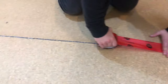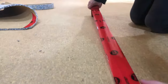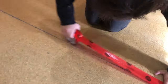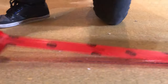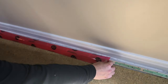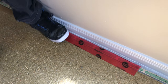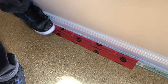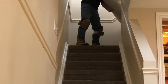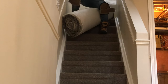The door is done. Now Robbie is putting down the tuck tape — the same tuck tape people use on the outside of houses. This stuff is serious; it's not going to crinkle or dry up. I've been using this for close to 10 years without one complaint. Masking tape dries up, shrivels, crumbles. We also put a little bit on the outside on the smooth edge because that marble is slippery — when we go to lay this carpet out, that pad is floating and it's going to move all over the place. We will put tape all around the perimeter. We're bringing in a big piece of carpet — about 28 feet — and it's Mohawk.